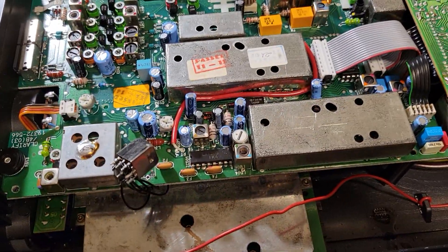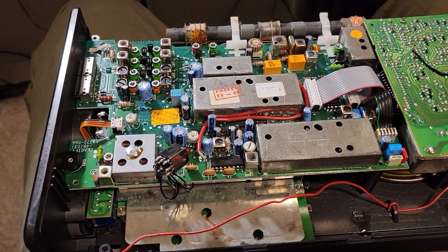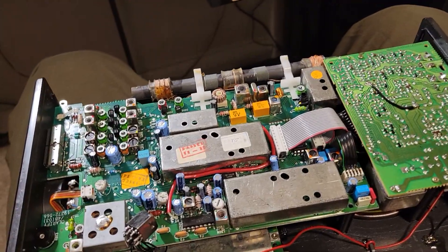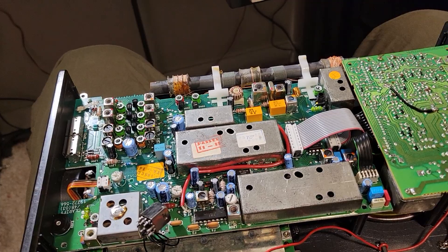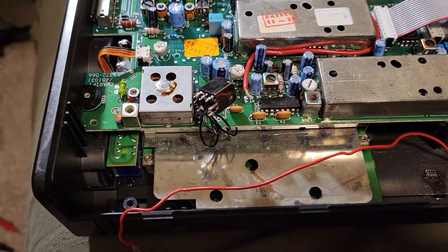So it's obviously some sort of filter or capacitor issue. All these capacitors look pretty new because this thing is in pretty mint condition. I figure it's probably the IF filter — it's actually a known problem for these Grundig radios. If you search 'dead FM no sound Grundig Satellite 700' online, the first solution that pops up is to replace the IF filter.